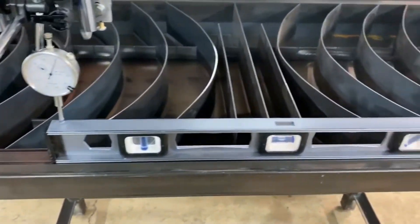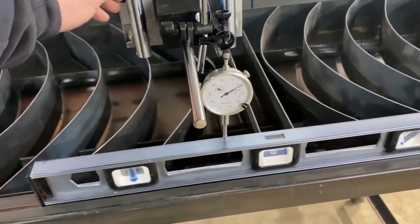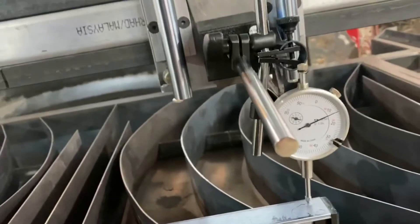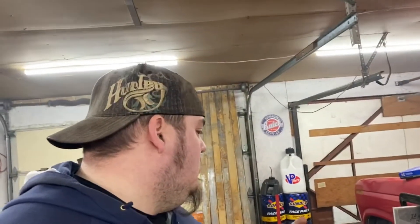So I tried a little something different — I just threw my level up there. It's probably the straightest thing I have in my shop. We'll start at zero here. Hold this runner down — it's about 10 thou up to the right, 15 thou. I've only used that level as a hammer twice, so it's probably way more accurate than this table is. I've checked the back rail as well and it's the same thing — about 10 to 15 thou up towards the right side. I'm gonna see if I can raise the right side a little bit — a half a degree or whatever 10 thou is across a five-foot span — and see if we can square it up and maybe start drilling some holes. The sun is starting to come up and I've just got nothing done.